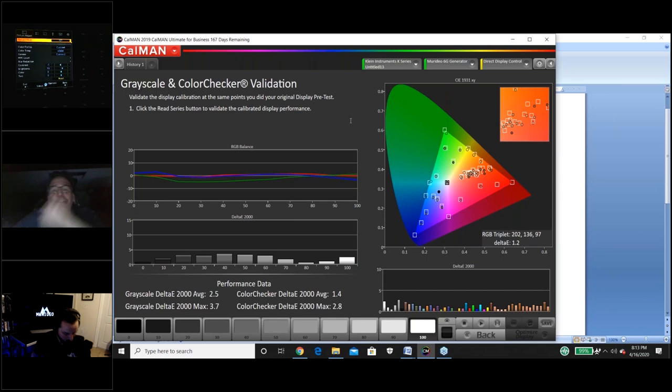Okay, so let's jump into HDR. Whenever you're doing an HDR calibration, some displays more than others, but I always do a base SDR calibration first, because sometimes, like on the Sonys as an example, everything for Dolby Vision and HDR10 is based on SDR. So do an SDR calibration first, make sure the display, or in this case the projector, is working correctly, and then go into HDR. That's what we've done in part one of this presentation.